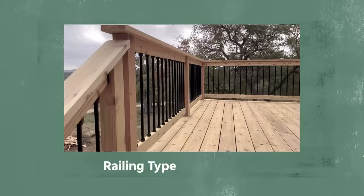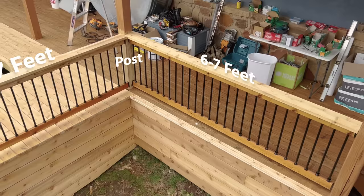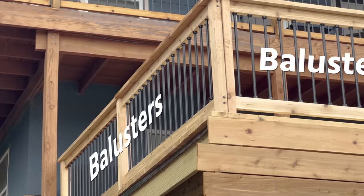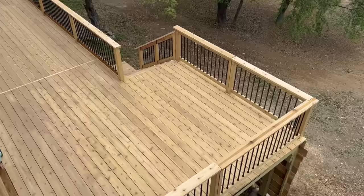For each section, which typically spans six to seven feet, there is a post on either end. These are connected with a two-by-four rail at the bottom and also at the top. Then balusters are the vertical parts that span between the two rails connecting them. My old look on the house was 100% wood, but since I'm building new I'm going to switch it to something easier to maintain as well as give it an updated look.